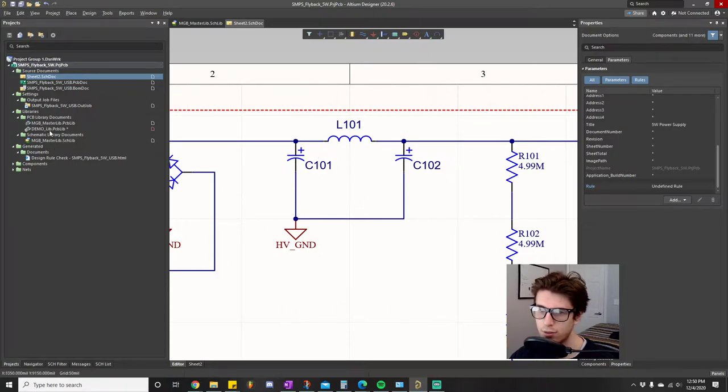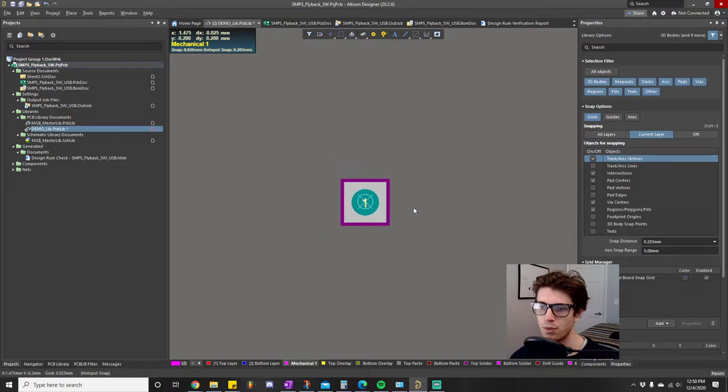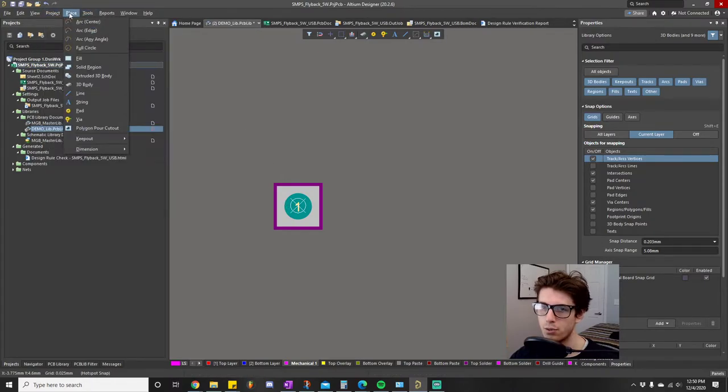The reason we're making this pad square is to provide a physical indication of which pin is positive and which is negative — it makes it more obvious. We're trying to idiot-proof our design and leave as many arrows pointing in the right direction as possible, so you'd have to make a lot of mistakes in order to mess this up.